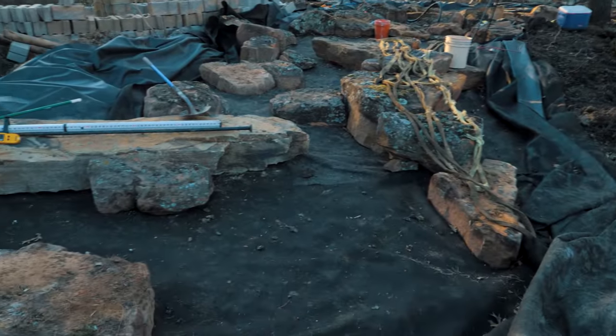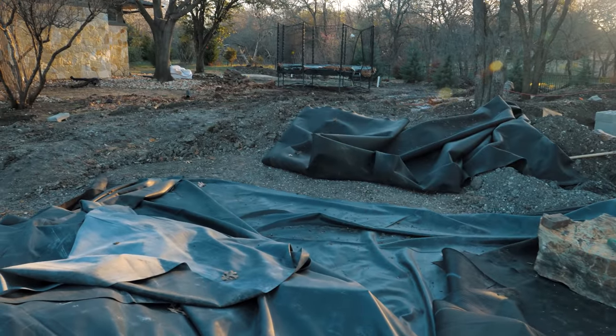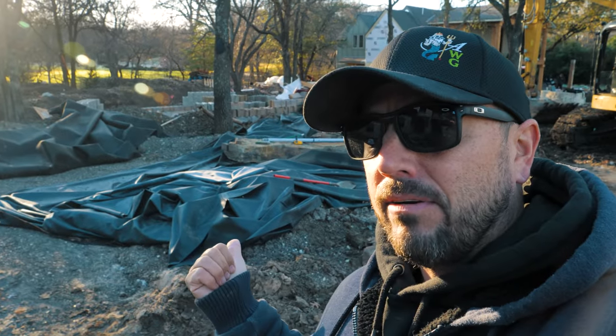Now that we've gotten done with most of the major part of the long stream, we're going to have a trio of Aquascape stack slate urns. First thing this morning we've got to get onto seaming liners. We've got this large section of stream that meets this big pooling area where those urns are going to be. We're going to run another liner from where the urns are all the way through over to where it meets the waterfall for that fountainscape — it's going to be a T-seam. Then we'll unbox those urns, get them over here, and mock them up.